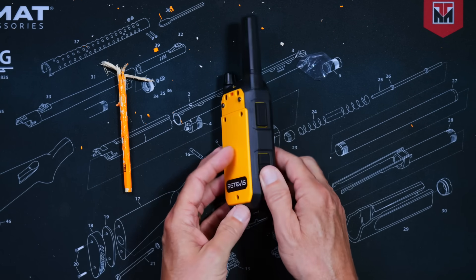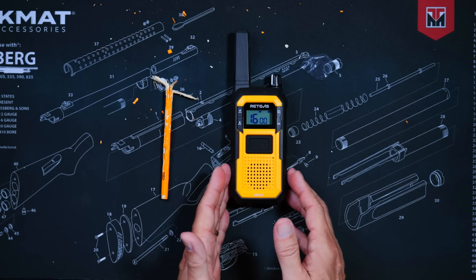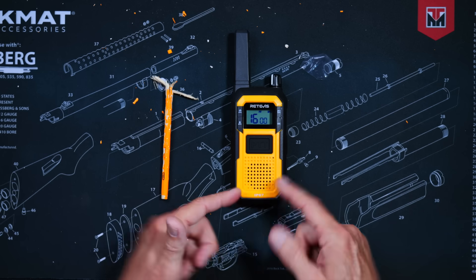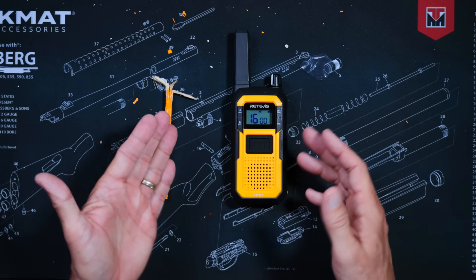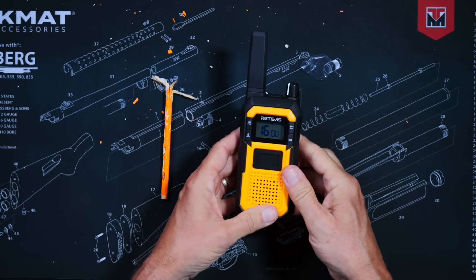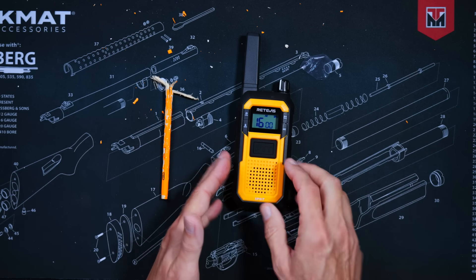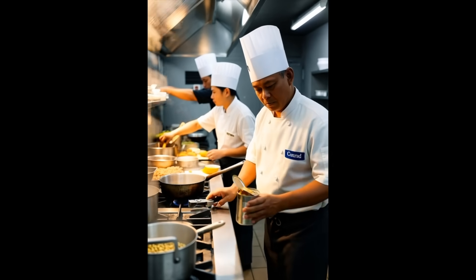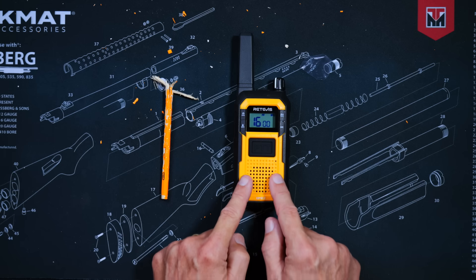The RB48 has a 2,000 mAh battery and it is an FRS radio. According to the FCC, no license of any kind is required to use this radio — anyone of any age and any gender can use one. It has the standard 22 FRS channels and can talk to GMRS radios since they share the same channels. As an FRS radio, you cannot remove the antenna for a bigger one, and it is limited to a maximum of two watts. Even so, I was able to talk with my friend Conrad the chef at his house 13 miles away while he was using his big base station GMRS radio — he was just barely able to hear me, but he heard me, 13 miles away.